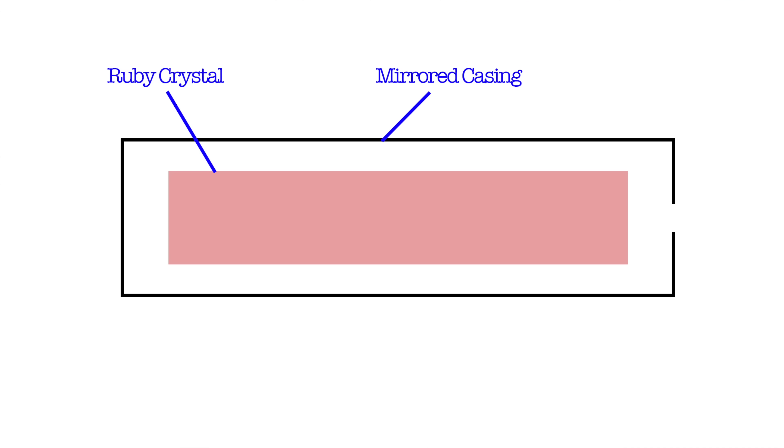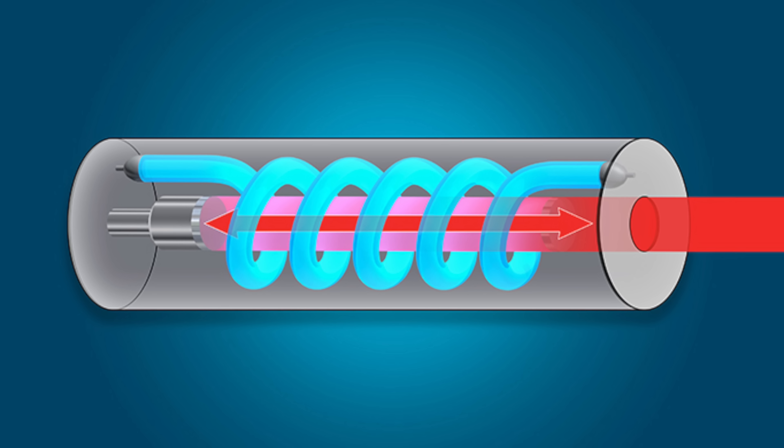Let's imagine it in 2D for a moment: a tube where, like my sphere, everything is a mirror on the inside, except we leave a hole open on one end, normally in the form of a partial mirror. Inside this cavity, we place a ruby rod aligned lengthwise. We wrap that ruby rod in the brightest lamp that we can muster. When we light the lamp, it emits white light in all directions. A lot of the light goes directly into the ruby, and any that misses will bounce off internally mirrored surfaces for another chance at the ruby.